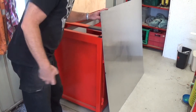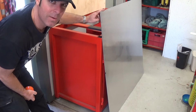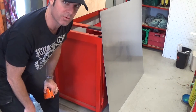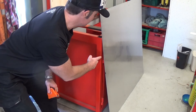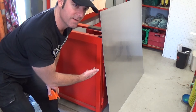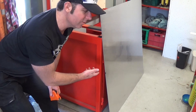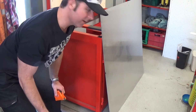I've got a sheet of 2mm aluminium. I have 1.6mm as well but I use that for fenders and tanks — 2mm is probably better for a tray. It's what I've got lying around; the stuff's not cheap but it seems the best choice for the job. It won't corrode like steel so I won't have to paint it, and the coolant mix I use is water-based, so aluminium is a good choice.